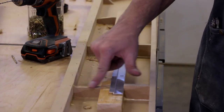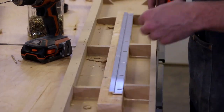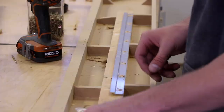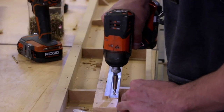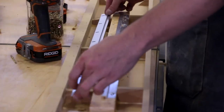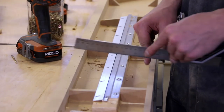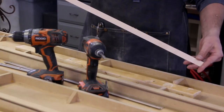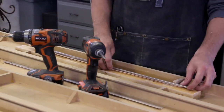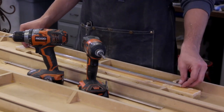So I did make a bit of a mistake here. I should have cut these down before I put them in, but I'm actually going to use the screws that they included. This hanger is supposed to support 300 pounds - whether I trust that, I'm not sure. They want me to put it up with these little half-inch screws, and I just don't trust it. You get it in the right vicinity and you just slide it right in there and it hangs on the wall. I might have to shim this a little bit though. Since we were a little bit short, what I ended up doing is taking a piece of hard maple, cutting that to size, re-drilling these holes through here, and that'll work as a spacer. A little bit of an oversight on my part - I should have measured a little more carefully, but stuff happens.